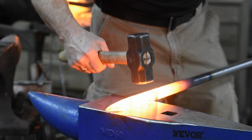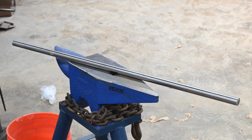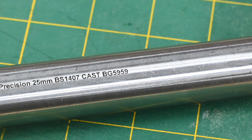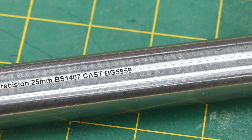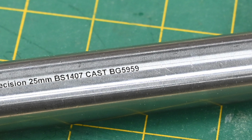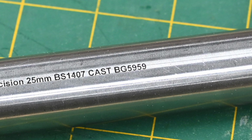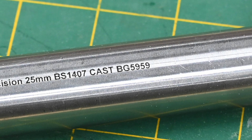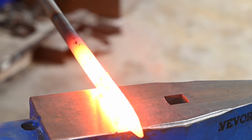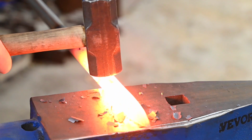popsknife.supplies. If you're curious about what silver steel is, it doesn't have anything to do with the metal silver. It's kind of the trade name for an English tool steel. It's sort of like O1 steel in the US in that it's the old standby of tool room steels in England. It's pretty different in composition though. It's got about 1% carbon, fairly low manganese, a pinch of chromium, and a little bit of vanadium, which gives it pretty high hardness potential. It's sort of vaguely comparable to 80CrV2. Now, this is a new steel for me, so I'm really interested to see how it works out.